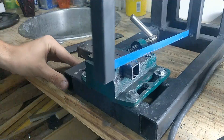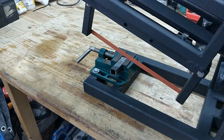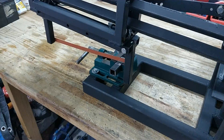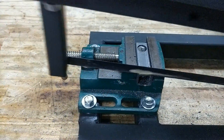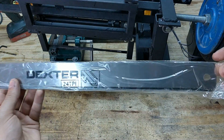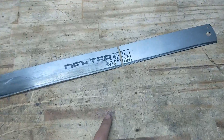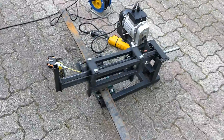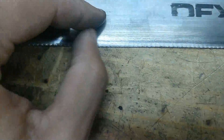However, I was starting to run into some issues with the blade. Although the counterweight almost completely cancelled out the weight of the slider assembly, the blade would still grip onto the steel, and since the motor had no intentions of slowing down — even with a ton of WD-40 — it would work fine for a moment and then just snap instantly. Also, because of the counterweight, the blade would just barely push down on the steel, meaning cutting speeds were less than impressive. The solution was simple: I needed a beefier blade. I got a 50cm blade made for manual mitre saws — wider and thicker. Since that blade was installed, I never ran into any problems again. It was a cheap one at about 10 bucks, and the teeth got pretty flat after a few cuts, but it still got the job done.